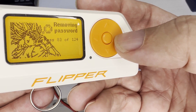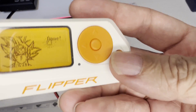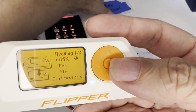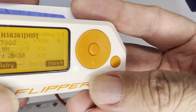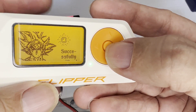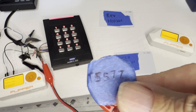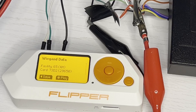If you used a custom password, you'd have to enter it on the previous screen. Now we'll go back and read that 29650 card — there it is — and then we'll go ahead and try to write that back to our T5577 tag. And now let's validate the data was written. We can see the card is 29650, so we rewrote the tag.